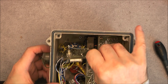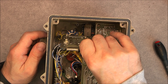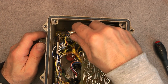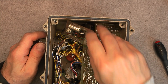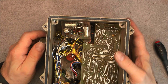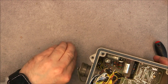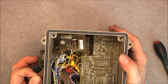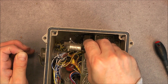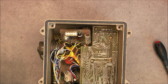Just a power diode okay. So it seems this is definitely our power input here, but I did already try to apply power across this capacitor and nothing happened, so I am not sure — maybe there is something blown in the power supply stage here.